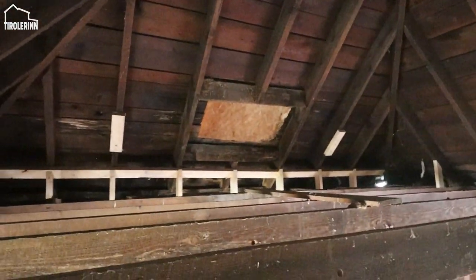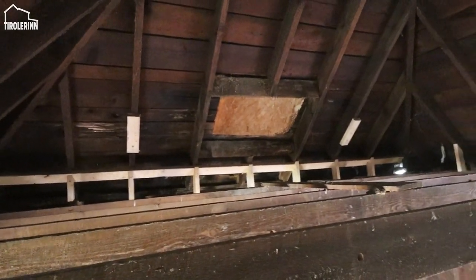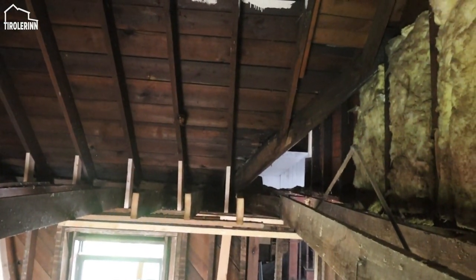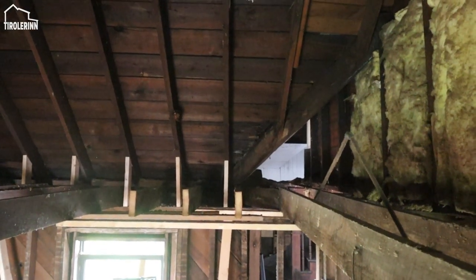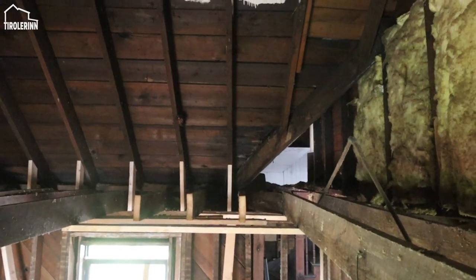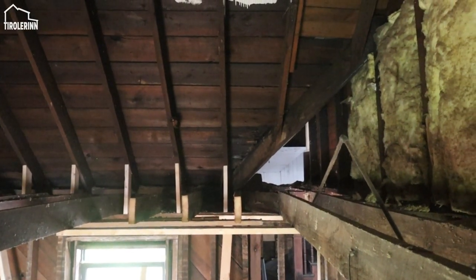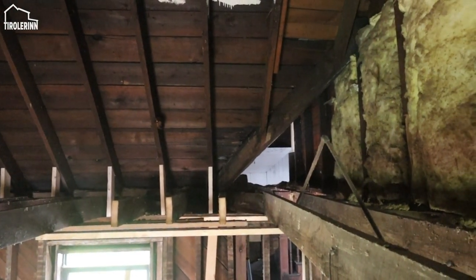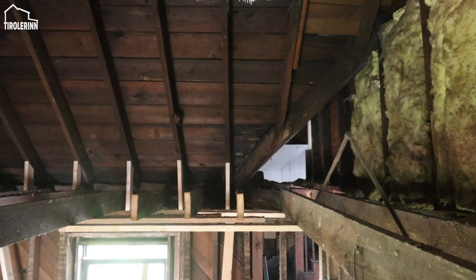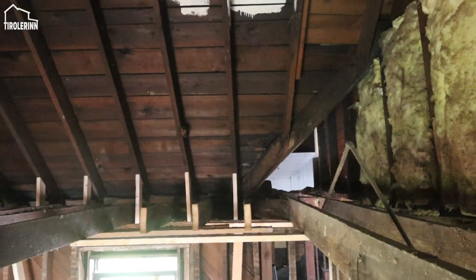What we will do is we will take these joists that you can see right here out. We'll actually take them out completely. We're just going to make an opening, and we're going to put a loft in this side of the room, stopping right at the window, because I don't want to put any of the weight on top of the window, because it would sag. They don't have a full proper support above it, a support header above it. So therefore, I don't want to put extra weight on top of that window, and we're going to make a short, probably about 6-foot loft up here for them to play, and we'll leave it open a little bit on the side so that the kids can kind of play from one side down to the other.